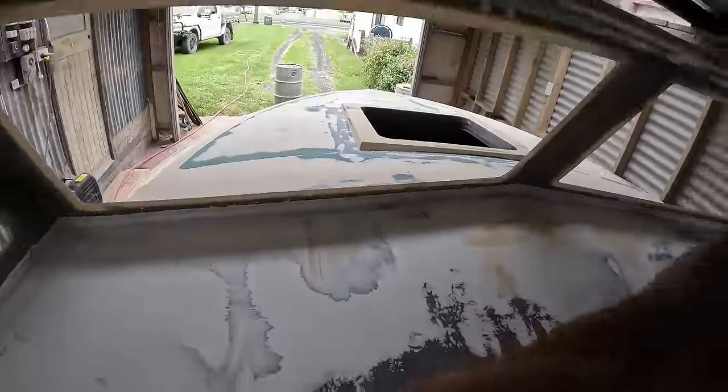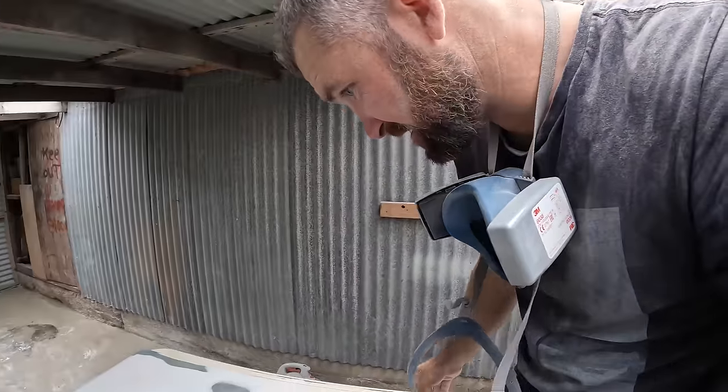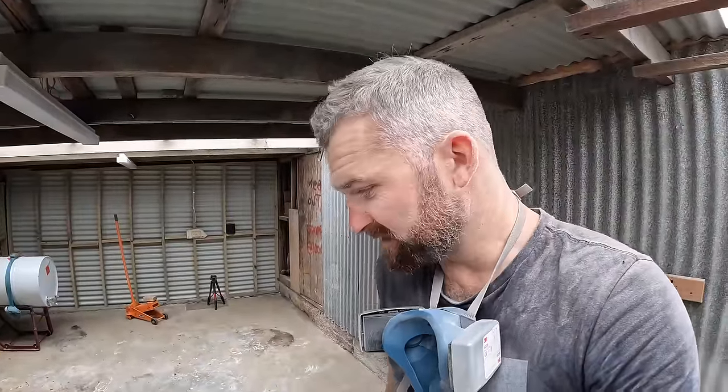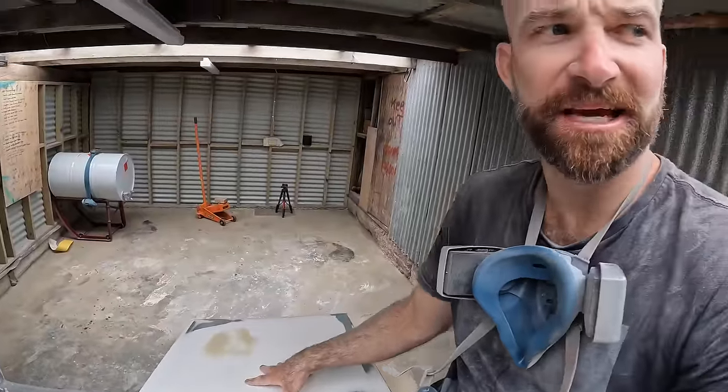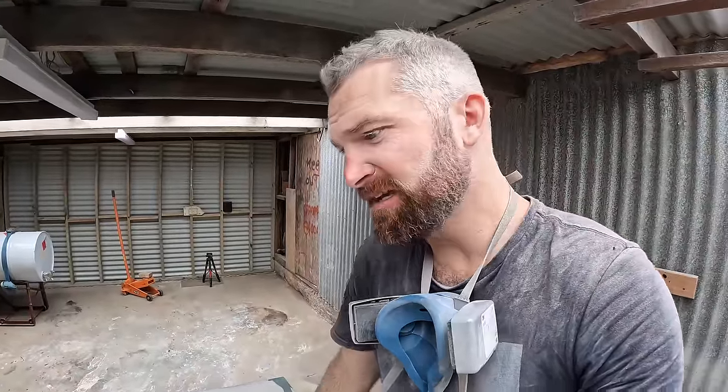So what we're going to do on the top deck also is a high fill primer. But first, I'm going to speak to the guys at the paint shop, as I've never done this before, but we're going to probably do an epoxy primer, which is going to give us a really good bond to the top deck. And then we'll use a high build primer, which is going to basically build up an easy sandable layer, which we'll then put a guide coat over and sand it all back down